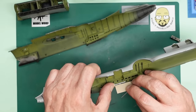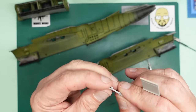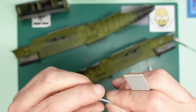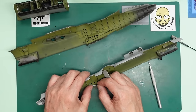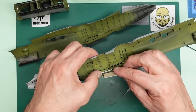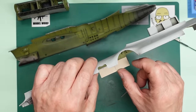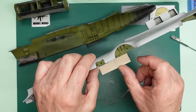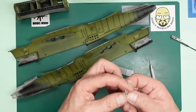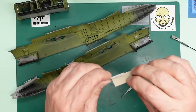the floor doesn't want to go in, it's in the way. So what I've done is cut some of that peg away. You can see there, so that the top of the peg is below the top surface of the actual bracket. So now I can put it in and pull it up, and when it's horizontal, then this floor will easily slide in. So it's almost like it's resting on it. So there we are. I also cut a little bit off it to allow it to go half a millimeter forward, because it was catching on there.